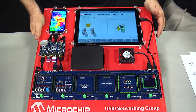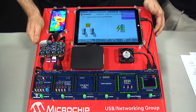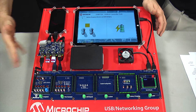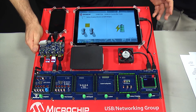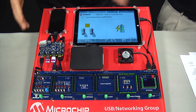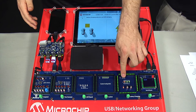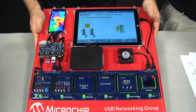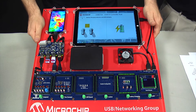Mode five is battery charging. The USB 5734 implements the USB Battery Charging 1.2 specification as well as common battery charging handshakes used by popular devices today. LEDs indicate whether battery charging is enabled on a particular port and whether a Charging Downstream Port (CDP) handshake has occurred. We can see that the phone has initiated that charging handshake, causing the LED to change. Extra GPIOs are also available to add more features to the system.